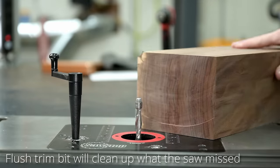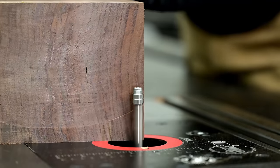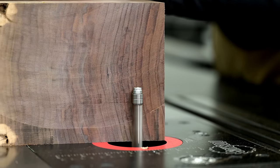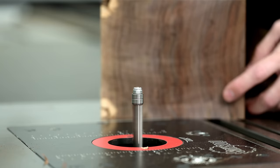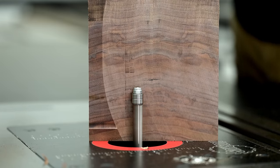I really like having a 12-inch miter saw, but we always max out our tools and need something bigger. The problem here was the 12-inch miter saw couldn't quite cut through this stock, so I had to come back with my router table and flush trim bit to nip off that last little bit.